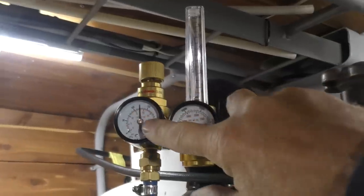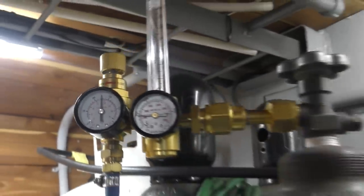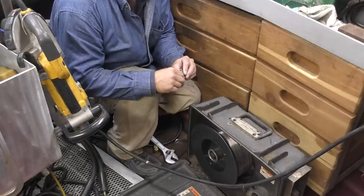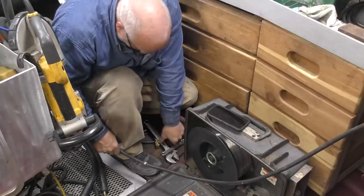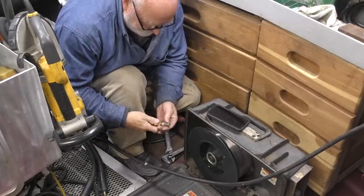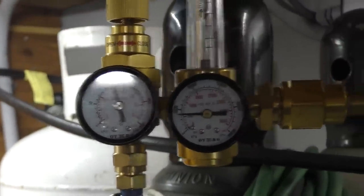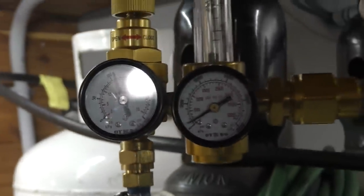It's showing flow because it has pressure on the line. If I turn the tank off and press that connector home while the machine's running, that should drop to zero if that's the problem. I have to have power on because the solenoid is electric. No change — so that's not the problem. That means it could be the solenoid inside the machine, or a mud dauber built a nest inside that connection again — I've had this happen twice on this machine. No mud dauber nest. I can confirm gas flows through the connection. Both needles went to zero as expected with the tank off. Turn the tank back on — we have flow. So it's not the regulator, not the hose, not the connection.